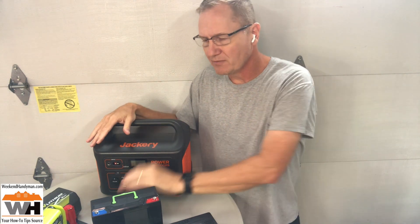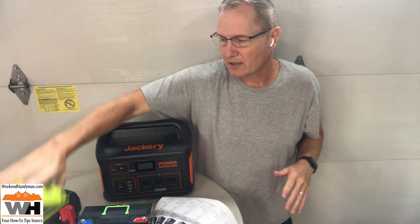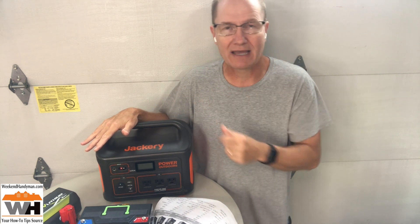So now we get to the Jackery. We'll be putting links in the description for you guys to check out a lot of things, because there are different inverters for different — you know, Ryobi has inverters, everybody has inverters now. The Jackery is a bigger unit; this particular one is a 1,000-watt continuous unit, meaning it can handle up to a 1,000-watt load continuously. This particular one is 1,000 watts continuous and can do a quick surge of 2,000 watts, meaning if you're exceeding 1,000 watts for a little bit it's going to be okay, but you can't ride above that 1,000 watts for very much more than a quick instant.